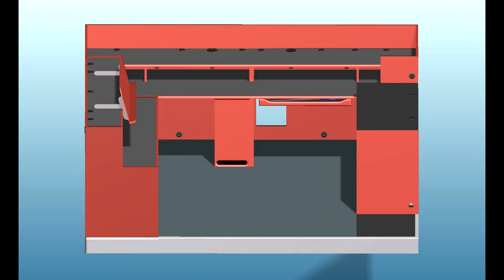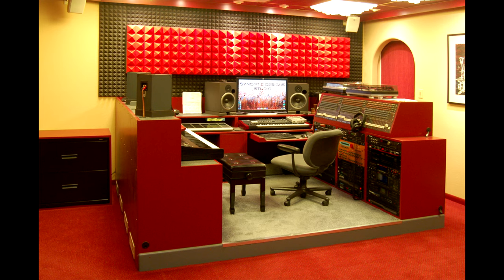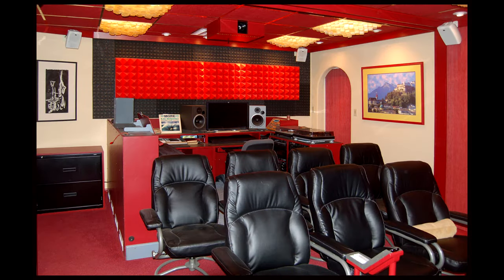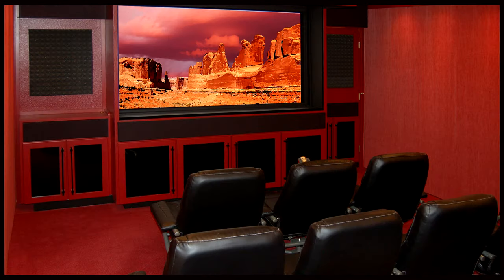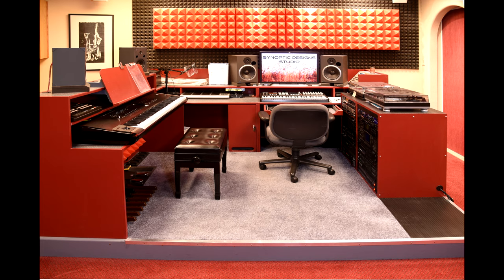This is a plan view — a straight overhead shot of the studio with the equipment installed. The platform is 9 feet wide side to side and 7 feet 7 inches deep front to rear. I had that width available while allowing for a necessary 30-inch wide passageway on both sides, and a similar setup could probably be accommodated in an 8-foot width. When I originally constructed it, access to the platform was via the open side of the U-shape. When I completed the home theater that shares the room, the theater seating blocked access from the front, so I had to pare down some equipment and eliminate the end rack case to use that space as a side entry. The plywood top surface of the platform is covered with carpet tiles, and I used rubber carpet runner matting for the entry and rack case tops.